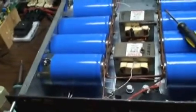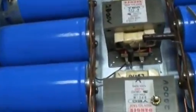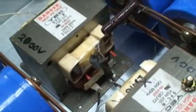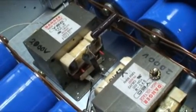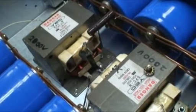When the original video was shot, we only had one microwave oven transformer. We now have two of them. In between, if I can get a good close zoom, is a bridge rectifier. How it works is the two transformers' primaries are in series, so they only have 50 volts on their primary. As a result, their secondaries are only 1,000 volts instead of 2,000.